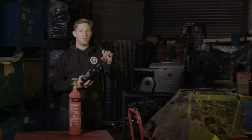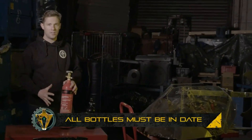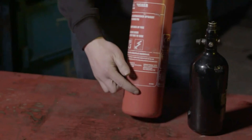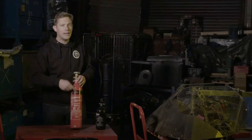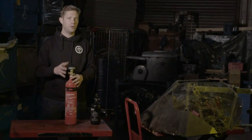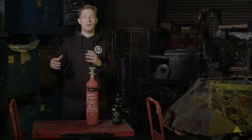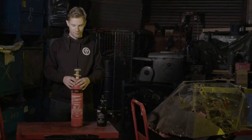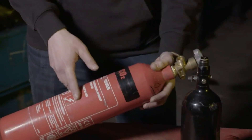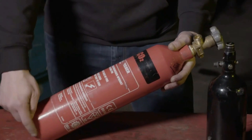If you use the screw-in method, you must have a manual isolation valve directly where the bottle is screwed in. This type of bottle comes from a fire extinguisher — really nice bottles to use, but they come with a dip tube. That's a tube that runs through the centre of the bottle down to the bottom, so when opened it draws liquid through the bottle and vents it. In robots this causes problems, especially with a low pressure system, because the liquid can run through the regulators, boil off, and create high pressure areas even past your low pressure regulator. We recommend halving the dip tube and curling it back to the highest point so you're always drawing gas rather than liquid from the bottom of the bottle.